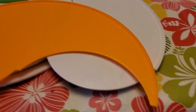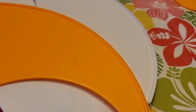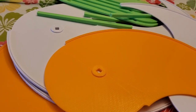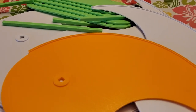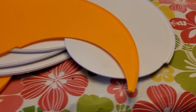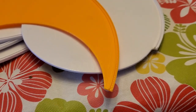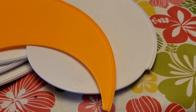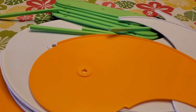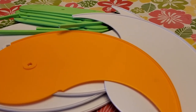There are the orange ones with the groove — a little better contrast. What I'm going to do on the next version is bump that sidewall in by about 30 thousandths, and that'll allow the sidewall to come up and lock into a groove on the top. I think that'll be a more positive connection, then you just put a little bit of super glue in there and you're good to go.